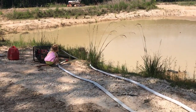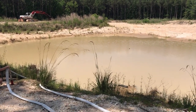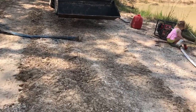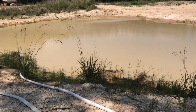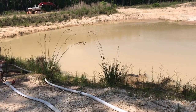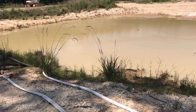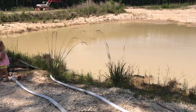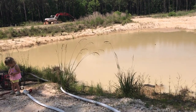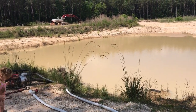I think if I can get a nozzle that'll focus it more as a jet, I'll be able to really kick it. But as is, even with that scattered spray pattern, it's hitting 30 feet. Whereas just coming out of the standard three inch discharge hose, I'd have to pick the end of the hose up and I might be able to throw water maybe five feet. That's by design — these pumps are designed to be high volume, low pressure. The way that you get projection on your discharge is to reduce the cross-sectional area, which increases the velocity. The pressure is actually less, but it increases the velocity, so it throws at a distance out of the nozzle.